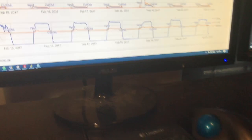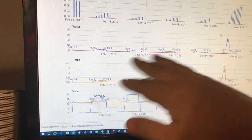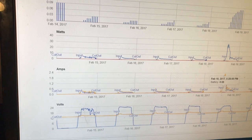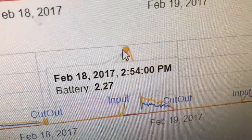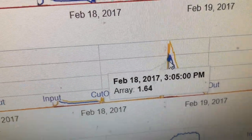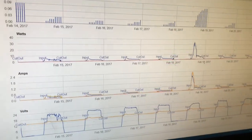If anybody's been following my videos, you'll see this here — it will be familiar. This is a project I've been working on to capture data from the e-log and display what's going on. I've actually learned quite a bit about how the battery works and how the MPPT works. For example, you'll see there's a lot more amps coming into the battery than the solar panels have — that's just MPPT converting extra volts into amps for the battery to charge a bit better.